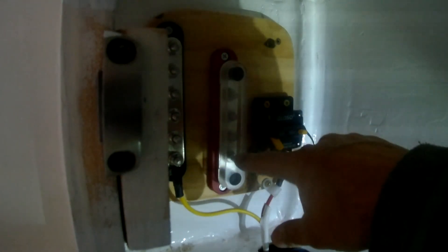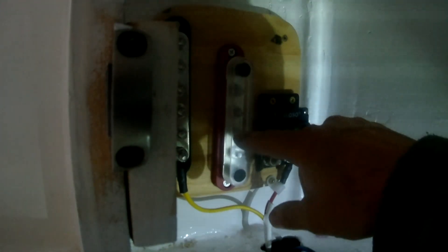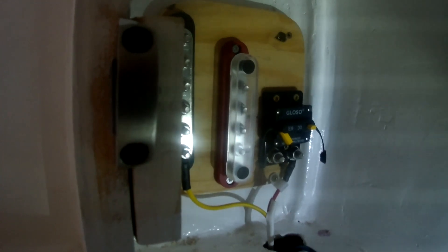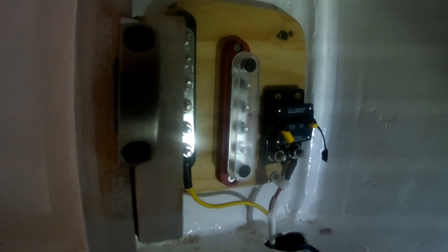This is my circuit breaker — it engages and disengages, and now I just need a little jumper to my bus bar. This is where I'll feed my DC panel — panel one and panel two. My bilge I want dedicated on the bus bar here, so it won't go through the panel. This 30-amp breaker is for all of my DC power. At my last count I was using just over 12 amps — 12 or 13 amps of the 30.